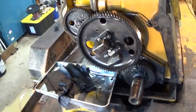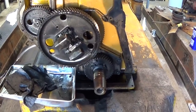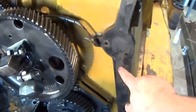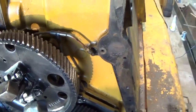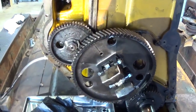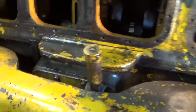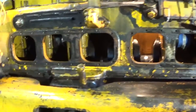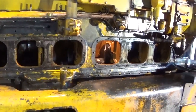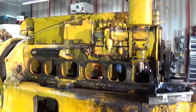The next video will probably be removal of the oil pump for inspection and flushing of all the oil lines. I'm going to need to plug this hole here temporarily as it feeds the idler gear for the water pump. Once I pressurize the oil gallery system, I can rotate the crankshaft and work on flushing everything out. I'm going to use fuel oil as the flushing agent — it seems to be working pretty well, it's not too aggressive and it's very readily available. Thanks for watching, more updates to come.